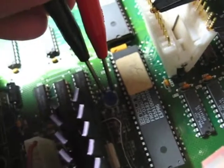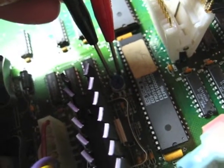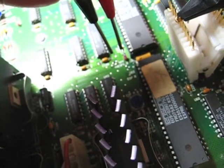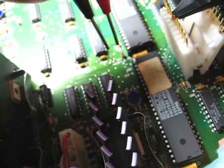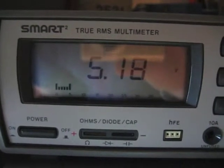My first goal here is to get this adjusted so it's exactly 5.25 volts. That voltage is measured at this test point here, which is TP7. As you can see, I've reduced the resistance too much — now it's at 5.18 volts.